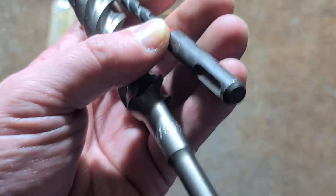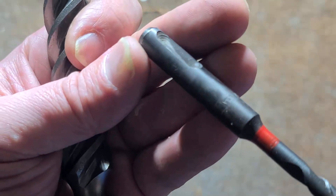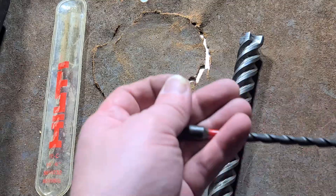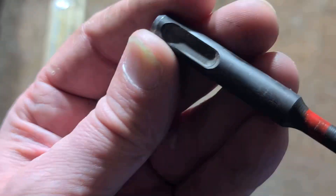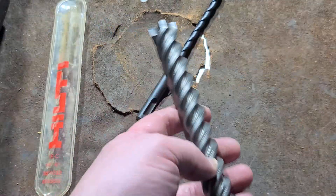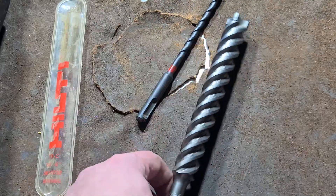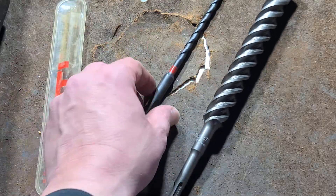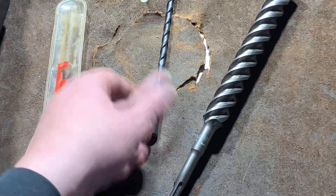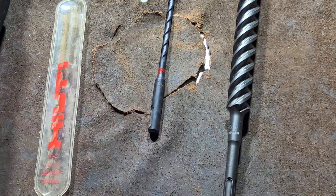So this is a little primer about SDS versus SDS Plus. Basically you'll have no problem. The only thing I'd recommend is staying away from buying old SDS bits, unless you have an old rotary hammer that will use them. Otherwise, you run into too many situations where you get these old SDS bits and can't use them with your new tool. They designed the accessories to be backward compatible so you can use modern bits with your old tool until it wears out. SDS Plus has been around for 20 years, but there's a lot of old construction supplies with old bits, and you'll just make that mistake and have to run down to Home Depot to get yourself an SDS Plus. So that's the little primer — thanks for watching.